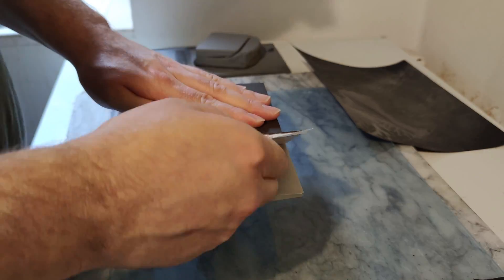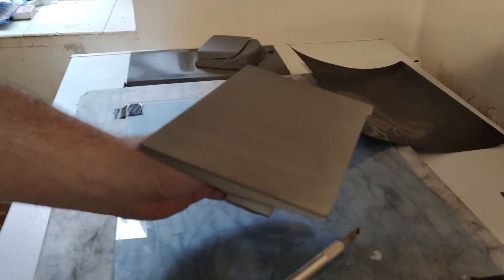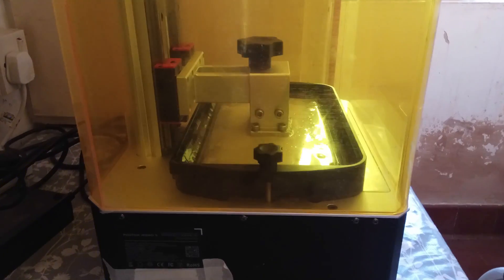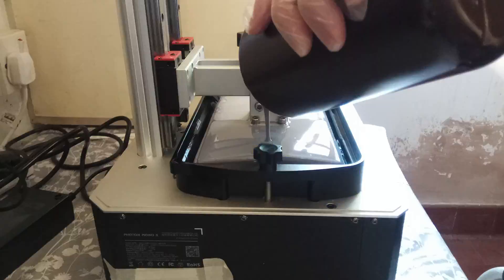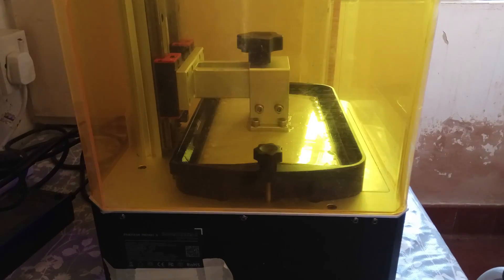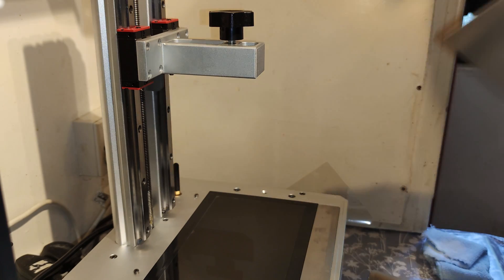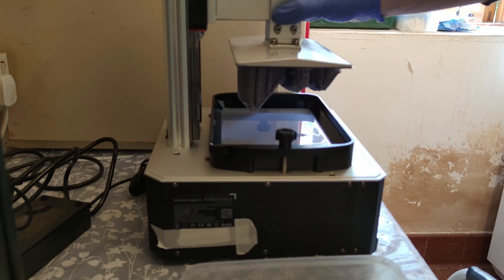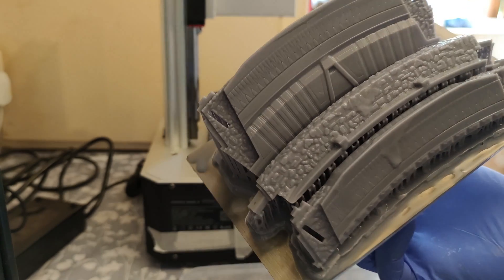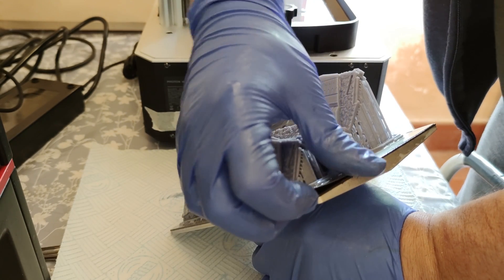I may have wasted many months of my time trying other magnets, but it only cost me £10 this time round. I prepped up a print and set up my camera for another timelapse. The first test print failed, but this was my fault — I paused the print partway through to see how it was going, and this must have somehow disrupted the previous layer's cure time, so when I resumed the print, the layer didn't adhere properly and the print failed. I removed the failed part and started the print again. This time the print completed without issue — success. The print shrinkage didn't pull the flex plate away from the magnet. It worked. It did take a fair bit of effort to remove the plate from the magnet, but this little extra effort is better than hammering away with a spatula.